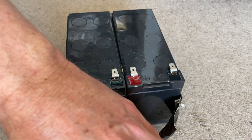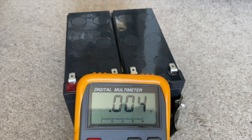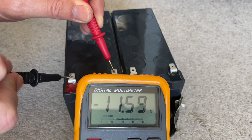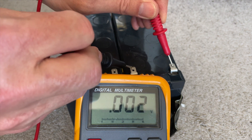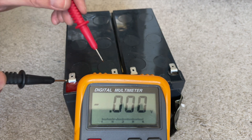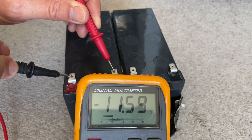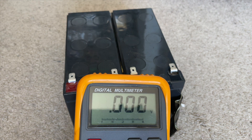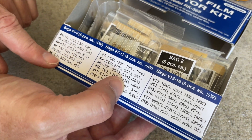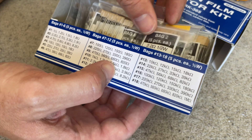Just for fun — there's absolutely no requirement for you to do this — I wanted to measure how bad the old batteries actually were. I measured their voltage: one showed 11.6 volts and the other 12.99, which is more like it. The first one seems to be in pretty bad shape. To measure capacity properly you need to put a load on it, but you can't just short a battery because the amperage flowing is pretty high. So I picked a 100-ohm resistor, which on 12 volts should result in a current of about 100 milliamps.